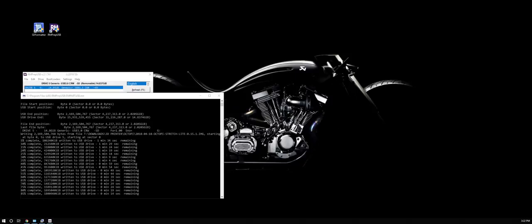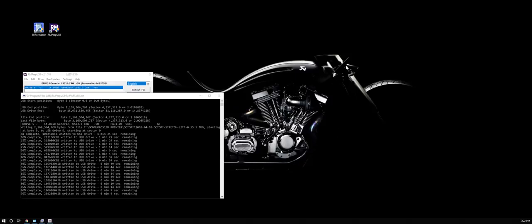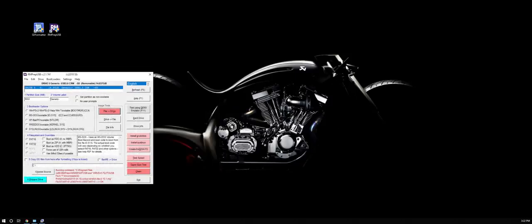My slight under extrusions went away. My walls started looking better. I get a little bit of that, what do you want to call it? People think it's the belt going over smooth surfaces showing up on their prints. I think it has more to do with the drivers you're using.